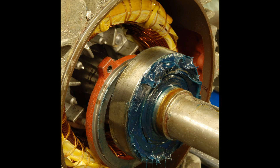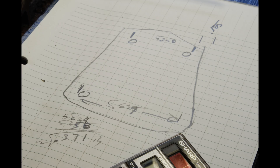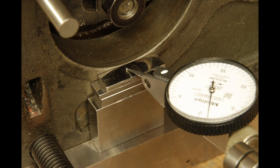The idea is pretty simple but there are a lot of carefully fit pieces. The back of the gearbox has two pins, as you can see in the picture, and we've got to very accurately create these in a mating piece of aluminum. There's also mounting bolt clearance hole locations, but caliper work is good enough for that. My first thought was to locate the three holes using the surface plate, surface gauge, and gauge box — clamp the part to a toolmaker's block so you can index at 90 degrees and find all the XY coordinates. Then with indicator, gauge blocks, and surface gauge you can get the exact location. It works, but it's tedious and there's a better way.